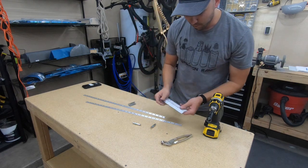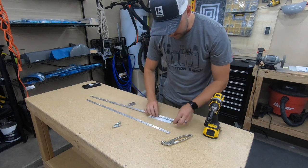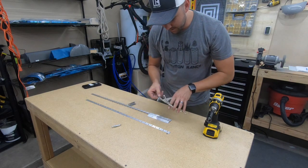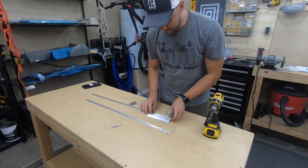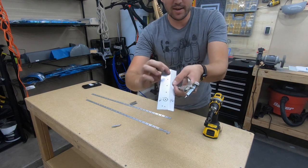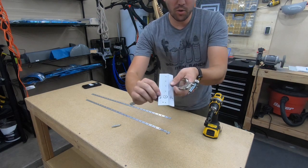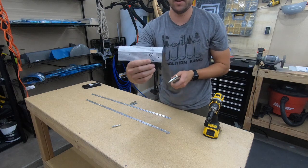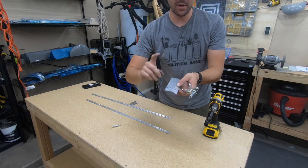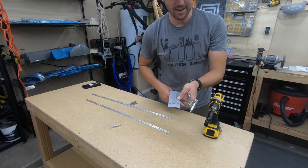The reason why that's important is I left these last three here to get on camera, but let me see if I can get this lined up here. First of all, you'll see they've all been match drilled to that trailing edge there. So it's all been match drilled. Ignore the 1/8 hole one. That was from a mess up I did on the trailing edge on the rudder where I had to go up one size. So ignore that one. But these here are what I've been working with on this one since I have not had any mess ups.